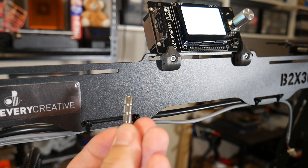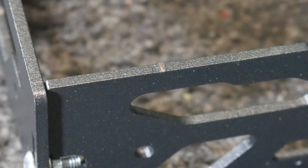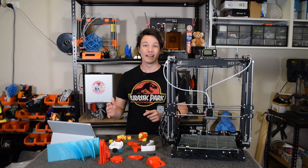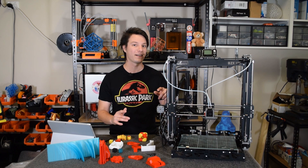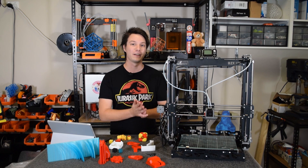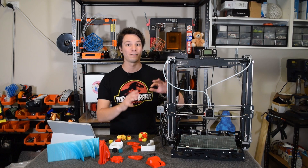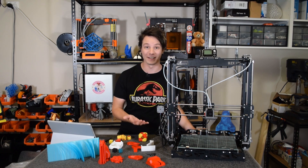One complaint: this is steel, and the powder coating on the parts means that those break points are raw steel exposed to the elements after you snap them free. I would recommend adding a little bit of paint over these exposed areas, or maybe even oil, if you're in a highly rust-prone environment, because 3D printers do rust.